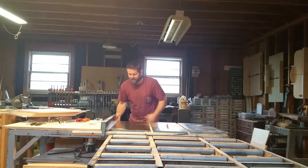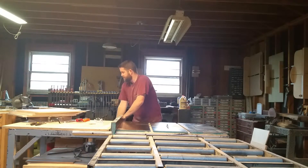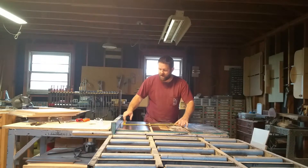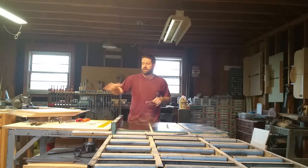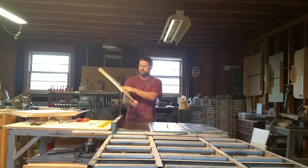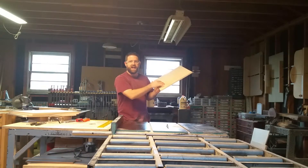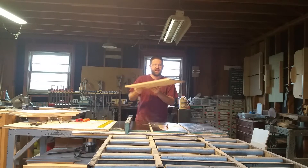I'll take the fence — it's currently on 20, so I'm going to move it to 17. I just like to be precise; my fence is extremely accurate and it's rare I have to readjust it, but why not play it safe every time — that way if you do need to adjust, you catch it early in the process. I also like to look at the grain figure on the piece and pick the ugliest portion to cut off so the prettier figure stays on the box. And to clarify — I'm going from 16 inches to 13 inches in height, not 20 to 17. I was thinking about the width rather than the height, which is what we're actually cutting.